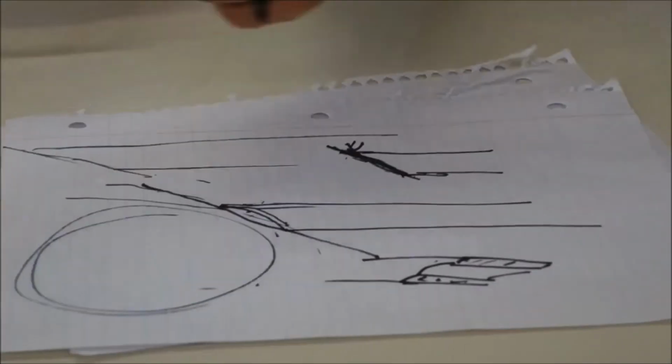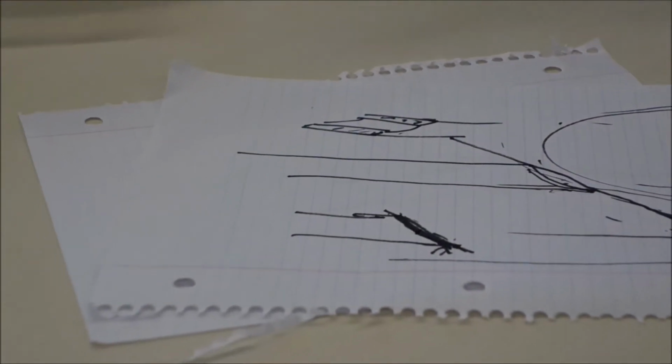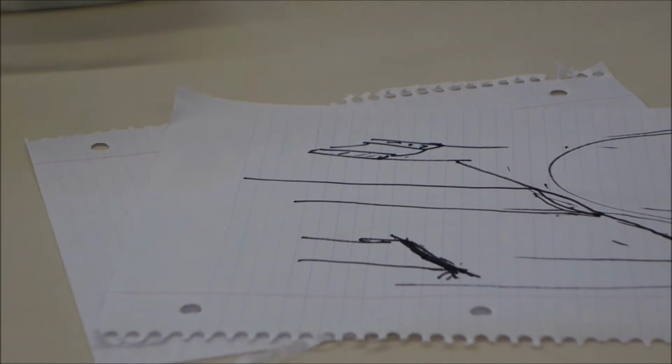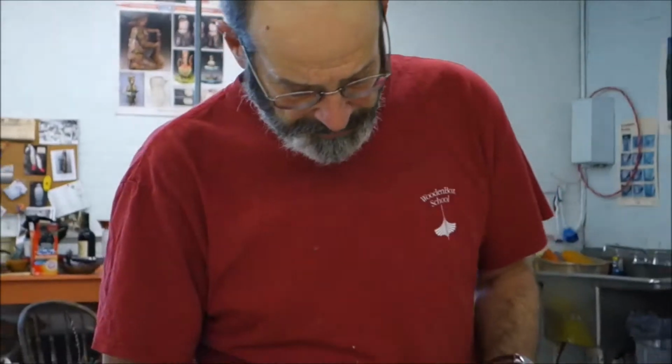So when you sharpen a chisel or a plane blade, after you've honed it, you always put the back of it down on the stone and give it a lick just to take off that burr. So even with these, you want to take that burr off. Can you feel it?